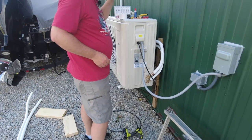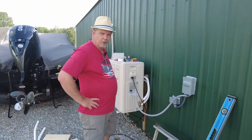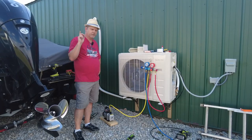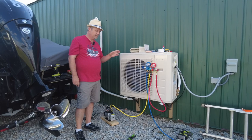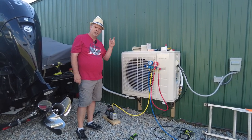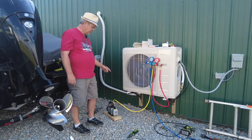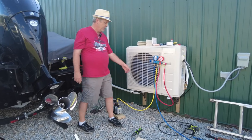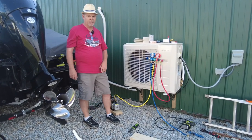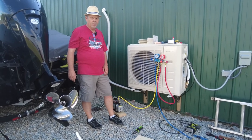We're ready to test our lines. So I'll get my vacuum pump out, get it all set up and come back and show you guys how it's done. We're ready to get started on vacuuming the system. So I picked this kit up online, and I'll put a link down in the description. But basically what it comes with is a vacuum pump and then the line set and a couple adapters. So it's everything that you need in order to pull a vacuum on a system.